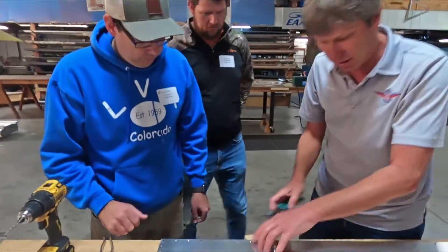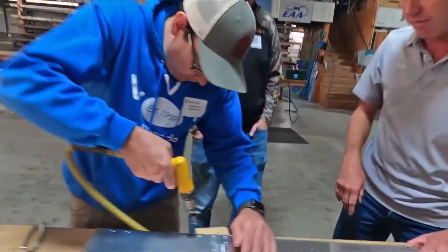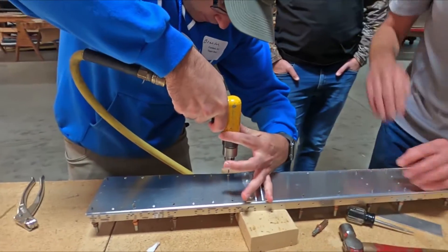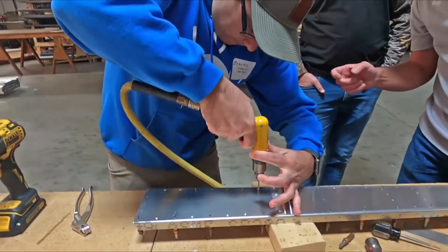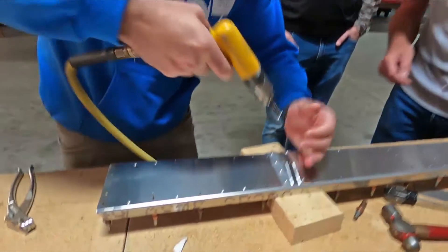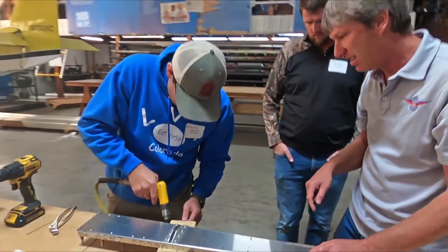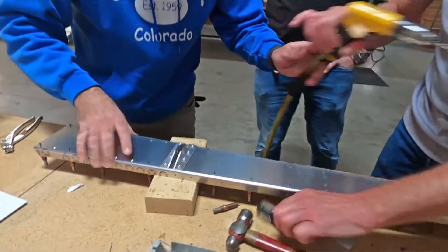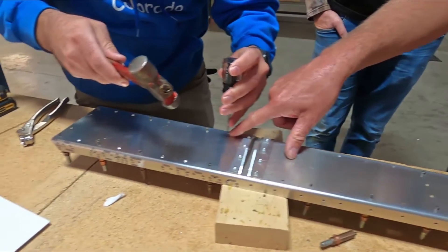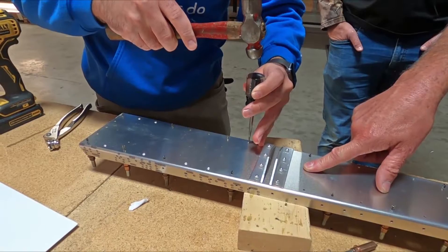Want to try one? In theory you can do this over and over again because you're not enlarging the hole. That's a nice thing about a rivet — it's only as permanent as you want it to be, but it's also removable. There you go — I hold it this way otherwise you might cut your finger. There you go, and then maybe try to tap it through first. The reason you're tapping it is there's a steel stem in there.